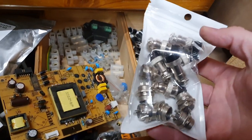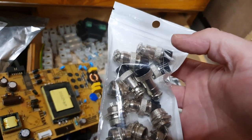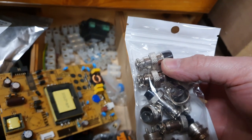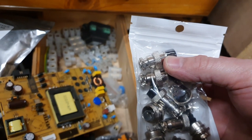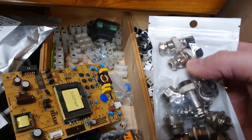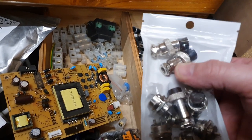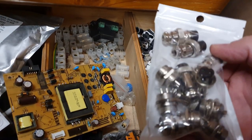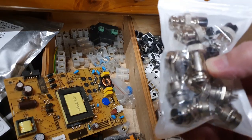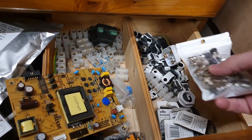So we're going to have one of them at 12 volt for the float switch for the PIDs, the other one 12 volt for the PT100. Yeah, so that's four of them, that'll do. So that would basically be the input under the bottom of the panel.